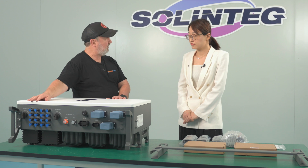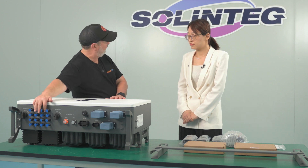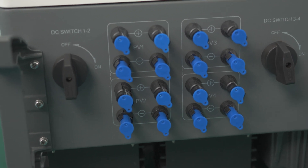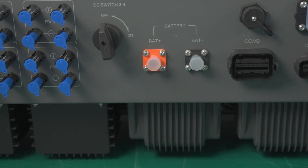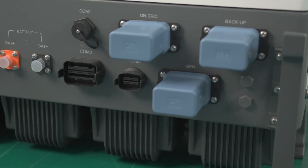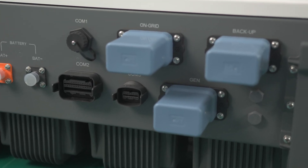The unit here has got four MPPTs from memory. Actually, we have two versions: one version has four MPPTs and each MPPT has two PV inputs. We also have the pro version which has two MPPTs and each MPPT has four PV inputs.